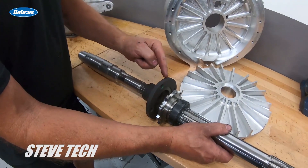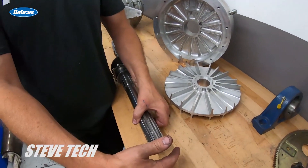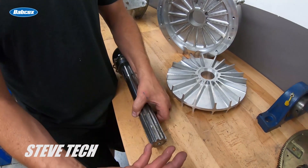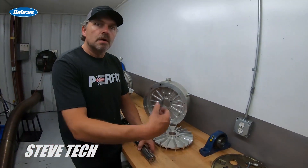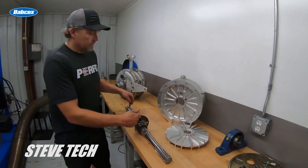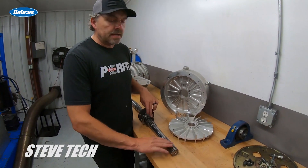On the motor side, we don't just run a regular flywheel on the dyno — we actually run a spring-loaded plate, similar to a clutch plate. It basically is a really heavy-duty overrated clutch plate with no slippage, but that spring-loaded center absorbs the harmonics. It keeps all the harmonics from transmitting through the shaft, because those harmonics break stuff and add a lot of problems. I've been using this style spline shaft for a few years now.